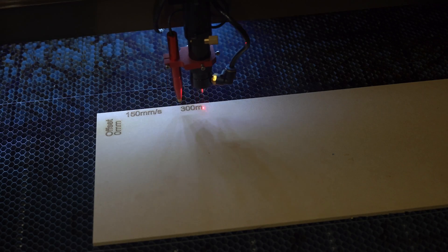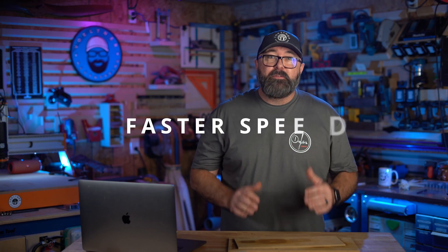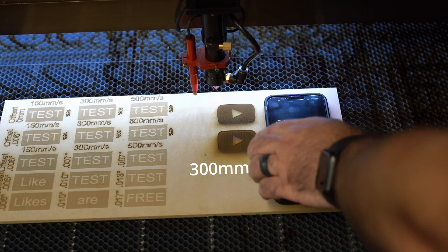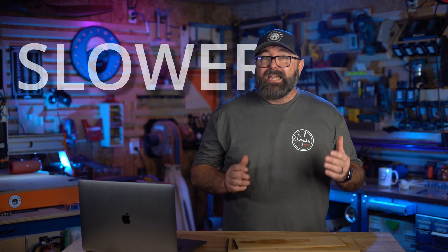Because what I've found goes against what other videos have said, I've run a ton of tests to make sure that my results were consistent between the three of my most common laser speed settings. It turns out that using a faster speed on the laser actually increased my total job time. I got terrible results when I increased my speed over three times my normal setting — at over three times the speed, my job finished slower than my initial test.